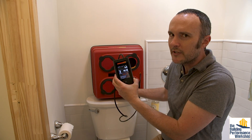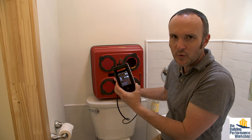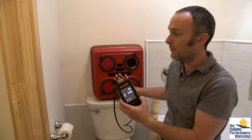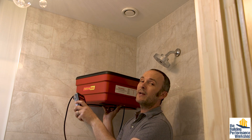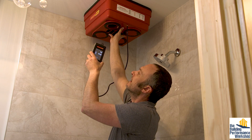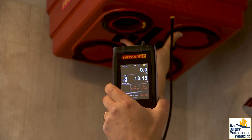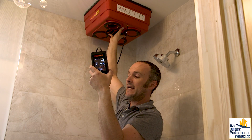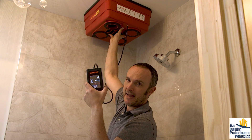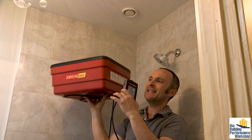Through my nine square inches of opening, I'm getting about 12 CFM of flow. That's great — for just over a toilet, 12 is all you need, and I was aiming for somewhere between 10 and 15. I have two exhaust ports in this room: one over the toilet and one over the shower. The shower port has the same dialable grill and is reading about 15 CFM. That's continuous — happening 24 hours a day. If I ever need to adjust it, I can always come along and change the dampers.